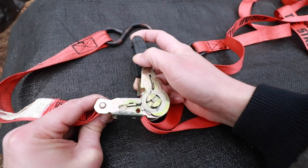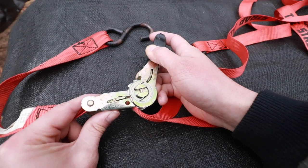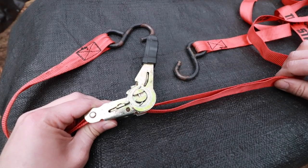That captures the progress as we ratchet this. So as I work this ratcheting mechanism, you can see what's happening — it's spinning the teeth, the spring-loaded tab is engaging with those teeth and therefore not allowing the tension to be released on the adjustable side of the webbing.